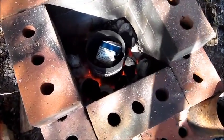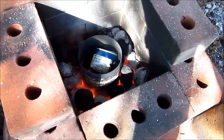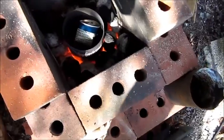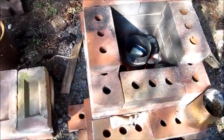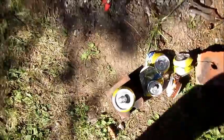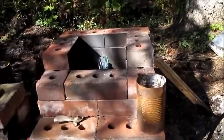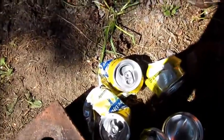It's been about 30 seconds since the last video and I've already gone through about five more cans. I've had to turn off the blower again, and I rotate the crucible every time to try to get an even heat. Even with the fan off, the whole bottom of the crucible is glowing red. I've also taken the propane torch and heated all these bricks, because if you have any moisture in your bricks and you pour the aluminum, your bricks will either crack or your ingot will end up filled with bubbles from the steam trying to escape. I keep crushing cans quickly — just putting them on a brick and stepping on them to get them flat, which reduces the amount of air getting in, minimizing slag and oxidation of the aluminum.